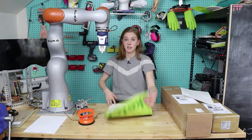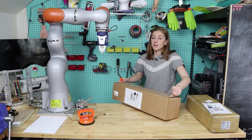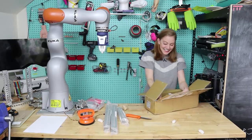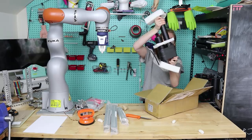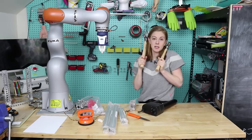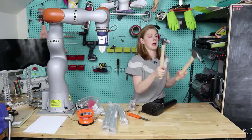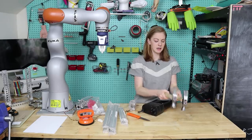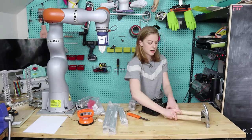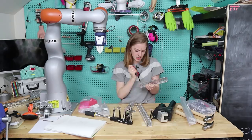I really need to make sure this fully works soon because I'm taking it to LA — I'm going to be a guest on Good Mythical Morning. I got a linear actuator, 560 pounds of thrust. The main mechanical challenge is I want to use only one linear actuator but have the hammers offset so they're not hammering at the same time. If they have the same pivot point but the motor lifts them from opposite sides, we should get that effect. I've made a lot of assumptions but I've also planned really carefully.